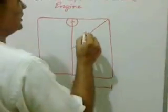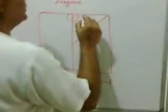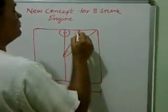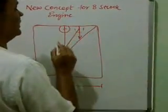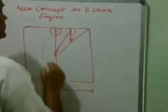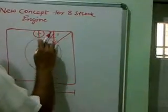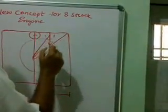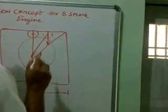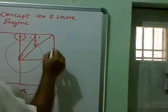There will be one expansion and the piston will go outside. This will be the second position and so on. In this position, a force component will act in this direction, which will give a torque to the rotor. Whenever this torque activates due to expansion on the piston, it will start rotating the rotor. Simultaneously, another phase starts.